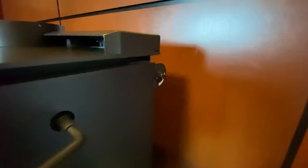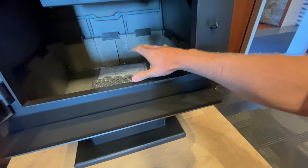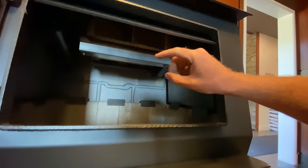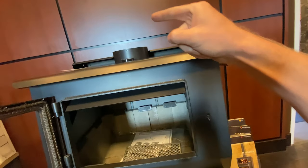There's virtually no smoke coming out of these things when you get them burning efficiently. You set your thermostat once — it's a little knob at the back here — and all you're going to be doing is moving it a tiny, tiny bit to dial in that secondary burn. It's amazing how responsive it is. If you turn that thermostat up, it's going to ignite the fire, get up to the new temperature, and then die back down again. It really messes with you the first time because you think your fire is going out. You don't see a lot of action in the primary fire, but if you look up at the top, it will be glowing red hot, doing that secondary burn — burning all the gases, keeping an efficient burn going up top.